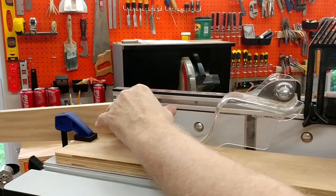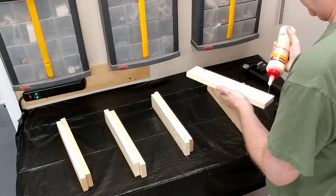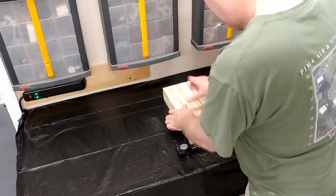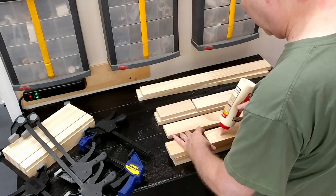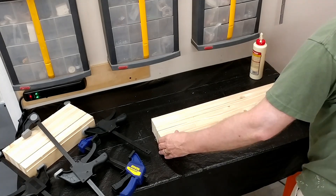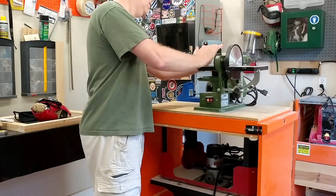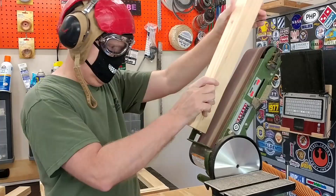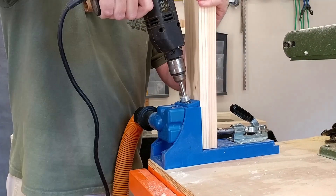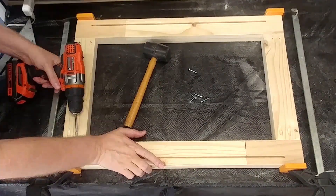The sides and back of the safe will be quarter-inch plywood. Here we're using the router to notch the vertical support so that we can inset those sides. These are the horizontal supports on the front and back of the safe that I'm gluing together. Next, I glued together the vertical and the long horizontal pieces that will be on the left and right side of the safe. All of the support pieces are run through the belt sander to square up their edges and smooth them out for paint. The safe is a cabinet, so it has an inside where we can put pocket screws that will never be seen. And now we attach the pieces together to create the front and back of the safe.